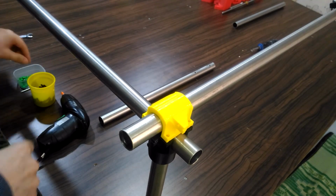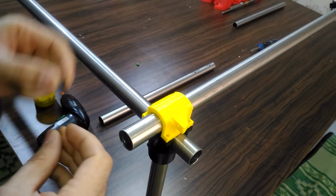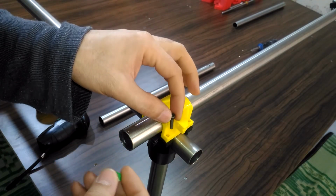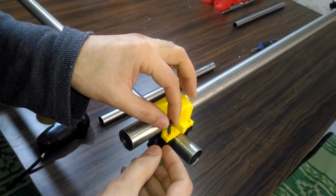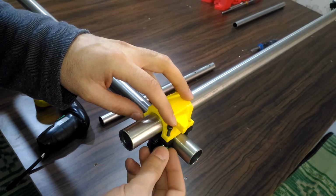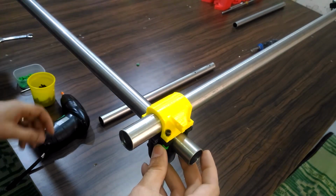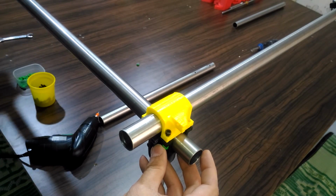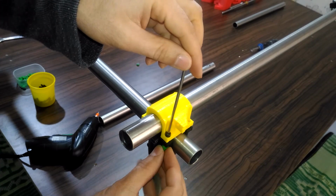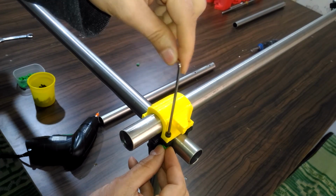Also, as an example, I will show you what I'm going to do in the coming step. We are going to put the four 20mm M4 bolts into the holes. The bolt goes through the hole from the top, and the nut with the lock piece will come beneath that. Because the frame is not stable at this moment, I'm just going to fix one bolt in each corner. Later I will do the three remaining bolts.